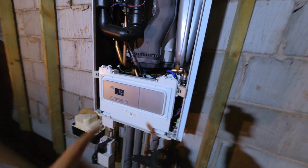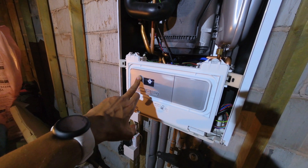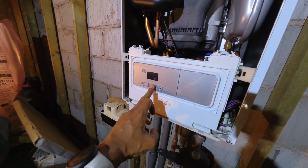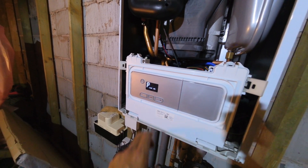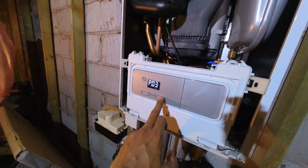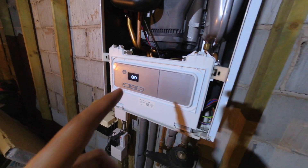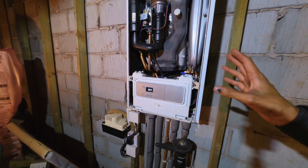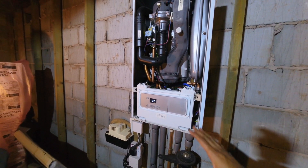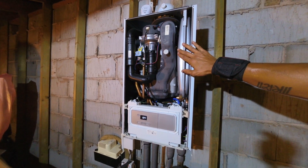To get the diverter valve into mid position, keep the off button pressed for five seconds and then keep mode pressed. You'll see three lines come up — P5 on this is mid position. So that's the diverter set to mid position. I can now drain the boiler out and it will drain everything, then I can take the expansion vessel out as well.